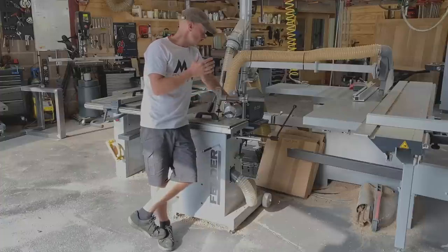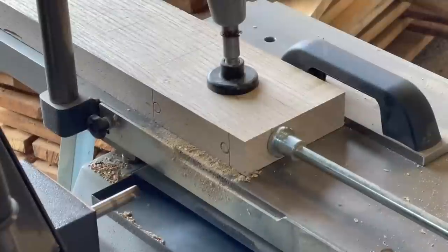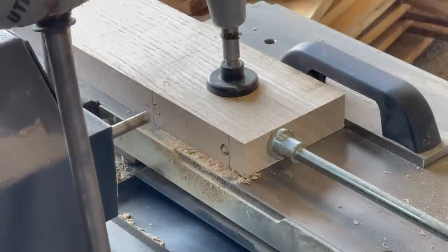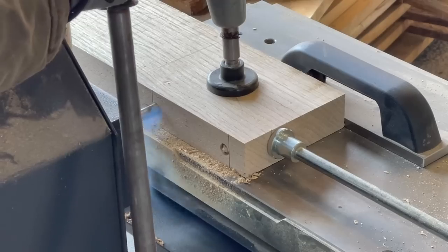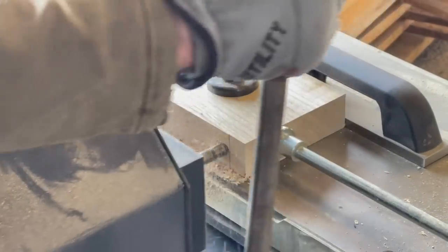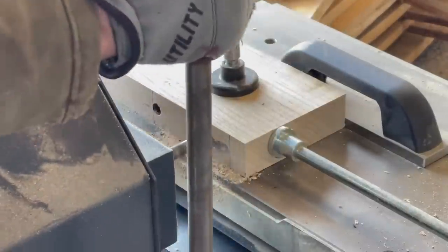You can wiggle the back really well for repeat work. First up I'm going to show you cutting the round mortises — it's nice and quick, really clean, and faster than the domino. The great thing is it's so repeatable because you've got the piece clamped, so for repeat work this is absolutely brilliant — you just steam in and go across.